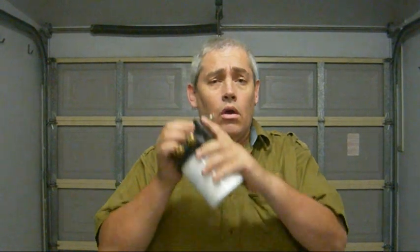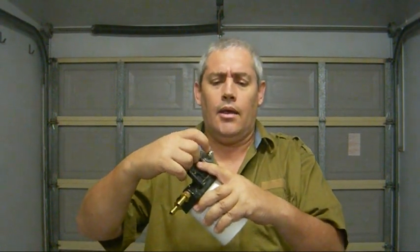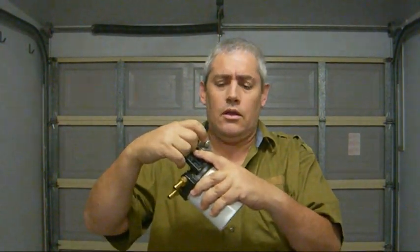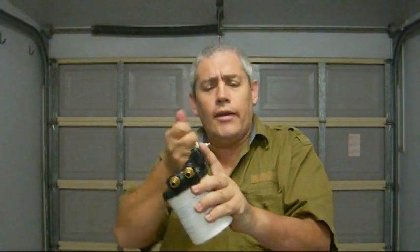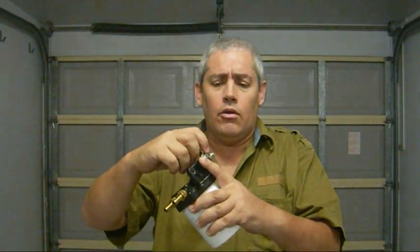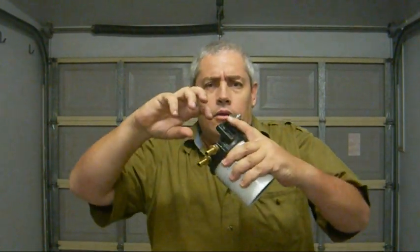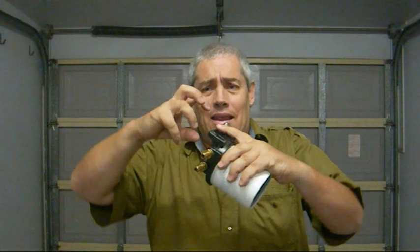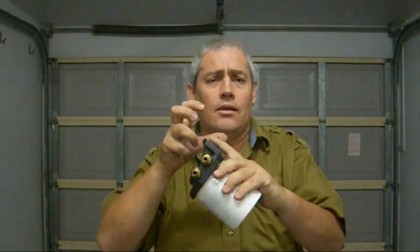So why does it occur? Well, without getting too technical, basically the roughness in the nut hits some roughness in the thread within the bolt, and as you're applying the force and twisting it, you've actually got metal that turns into a plastic state and moves and bonds together — and that creates the cold weld.